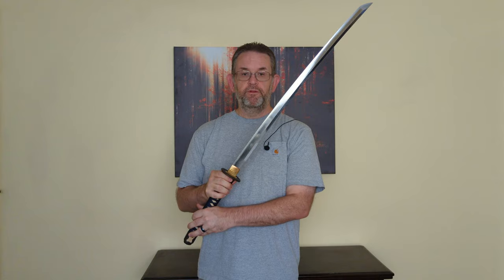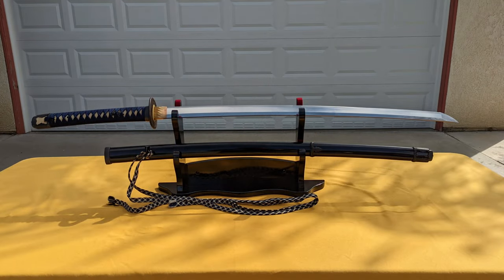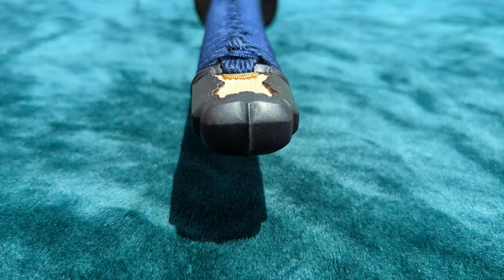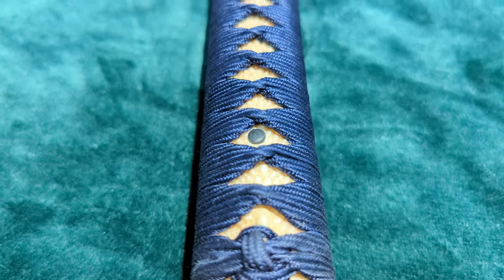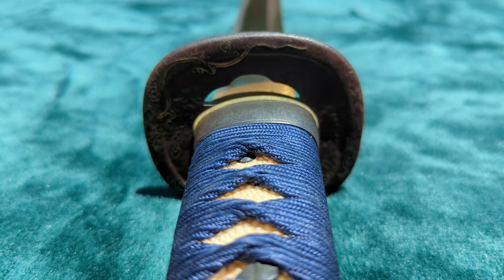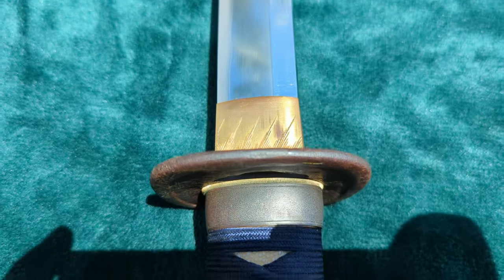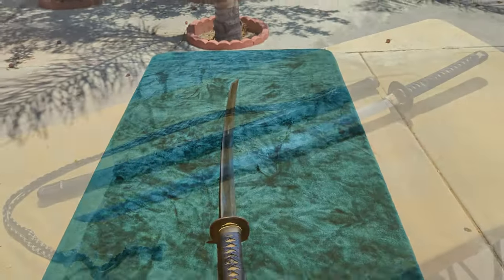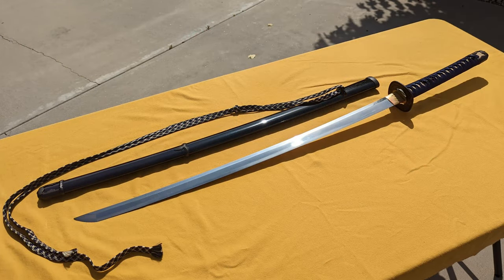To give you an idea of just how difficult the heat treatment is, Mr. Clark made a total of 3 blades for this order. The first 2 cracked during heat treatment. This is a big part of the reason that Mr. Clark's L6 bare blades start at $5,000. So if you see a non-Howard Clark katana advertised as being made from L6, chances are pretty good that it's not going to have gone through the correct heat treatment to form bainite. I believe Hanwei had some success in this regard before their factory fire, but that's mostly based on my hazy recollections and hearsay.